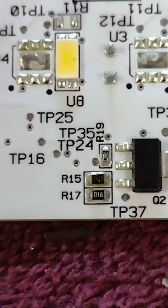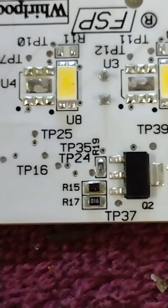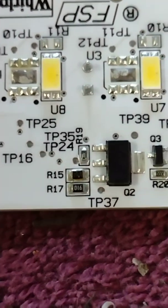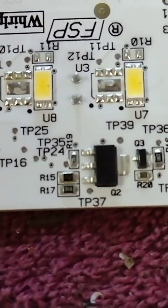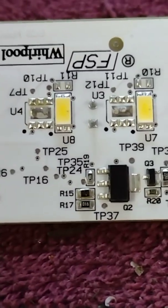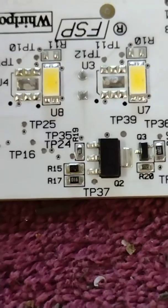Online it's suggested that R15 is 172 ohms. To me, this board is designed intentionally to fail because this is apparently a common problem. I'm going to try putting a 1000 ohm resistor in there because it seems like this is severely out of spec and intentionally done so that the board will fail and you'll have to buy a new light assembly, which is over $50 — which is ridiculous. Without a schematic I can't make an educated guess; I just have to go on feel.